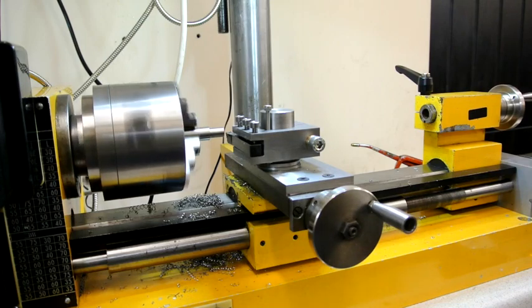Now I've shown you cutting at 0.5 depths of cut — that's half a millimeter depth of cut in stainless steel running at 540 to 550 RPM. Which for a tiny lathe like this, that is pretty good. If it's too slow it'll bog down, but at that speed it's fine.